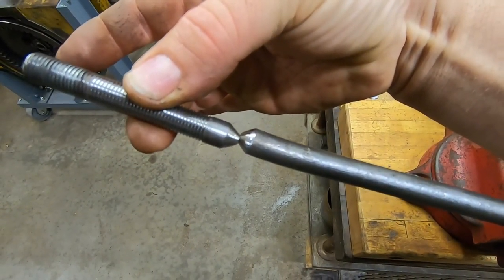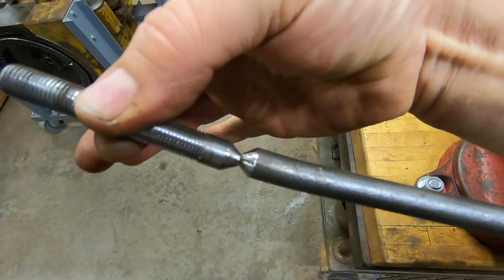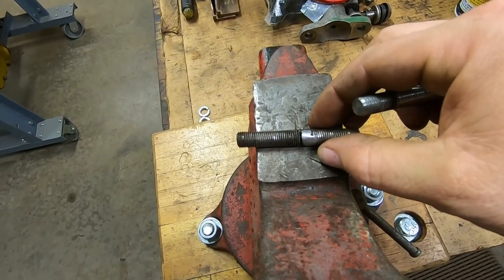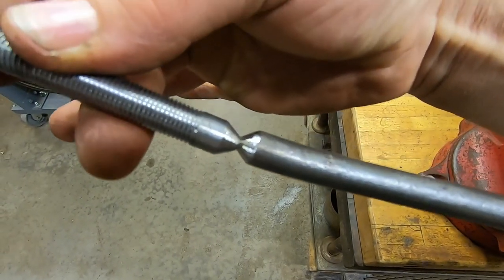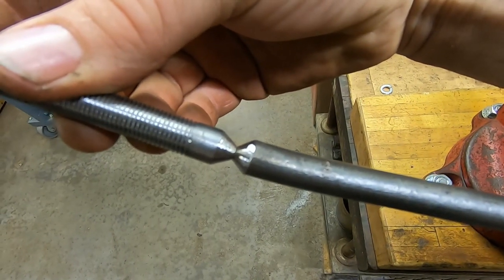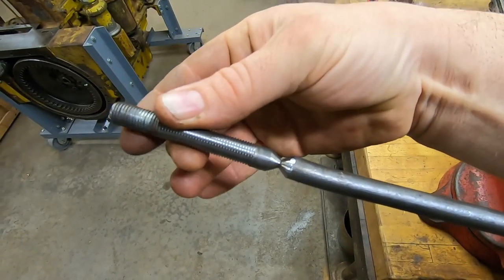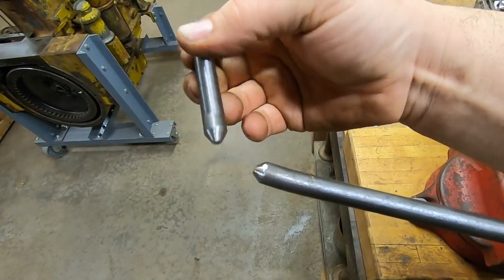We've got it ground so we've got a good fillet that we can refill. What you want to do is take as much of the old crack out as you can. They did not grind any of that crack out — they just welded right over the top. The problem is you still have a cracked bolt in the center, so that's not a very strong repair at all. The more material of that joint you can replace with weld, the stronger it's going to be. We've got these ground down just about to a point — for this application that's going to be plenty good. I'll brace this up inside a small piece of angle iron to keep everything square, tack weld it, fill in the rest, and flush it down round.